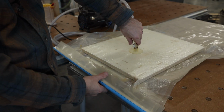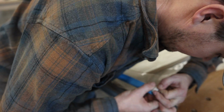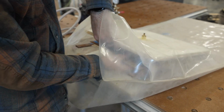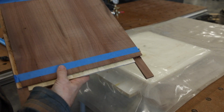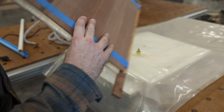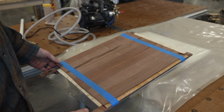All right, let's go ahead and pull the vacuum bag again. Pull the panel, square it up, check it out. Everything is attached, pressed down. You can see the creep that I was talking about. Some of it actually came out, and that's why I used the dark. It either goes through a void or something in the wood. Obviously, this is just for practice, this veneer isn't the most perfect wood there ever was, but we'll clean that up.